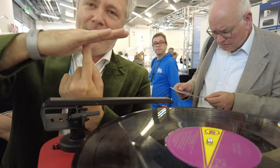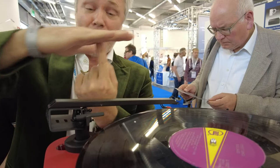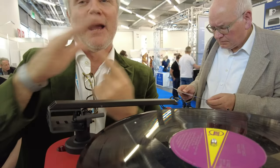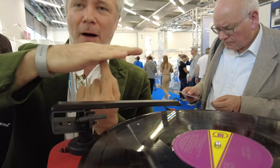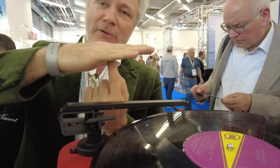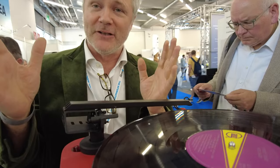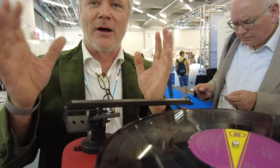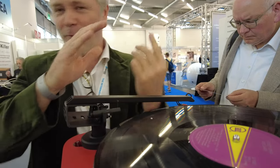Yes. And if you have a flat surface, which is what the pivot point really sees, then the arm is constantly being yanked like this. It might work well for the first 10 or 20 records, but at some point you've got an arm that actually has play. It climbs up the bearing or climbs down. It's always moving in the time axis, yeah. Which is your worst nightmare. It's like jitter. Absolutely. The thing you don't want. Not to mention azimuth. Exactly. There's all kinds of problems.